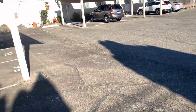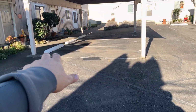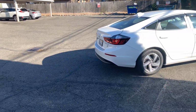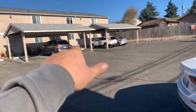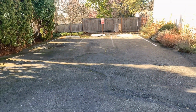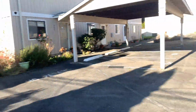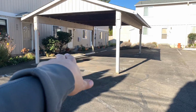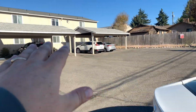We got one catch basin here. You got 3 carports. There's 3 wheel stops that we can salvage and then reset after taking out all the asphalt and putting in new. But we'll have to remove 1, 2, 3, 4, 5, 6, 7, 8, 9, 10, 11 extruded wheel stops, dispose of those, and then put back the 4.5-inch tall standard wheel stops. So there'll be 11 new ones in that area and there, and then we're gonna reset those 3 wheel stops there. We'll also paint the 11 wheel stops in this area.